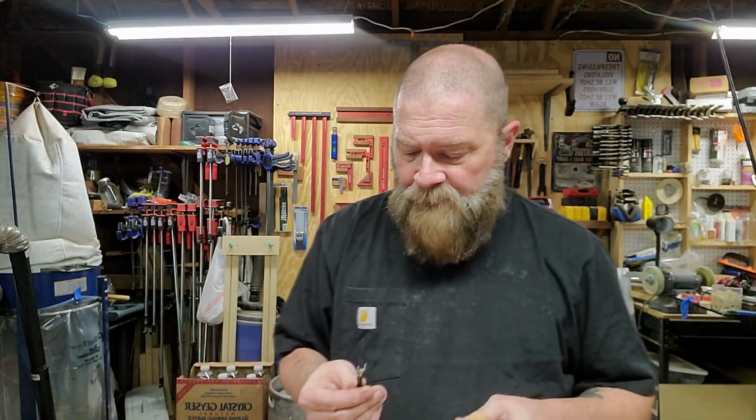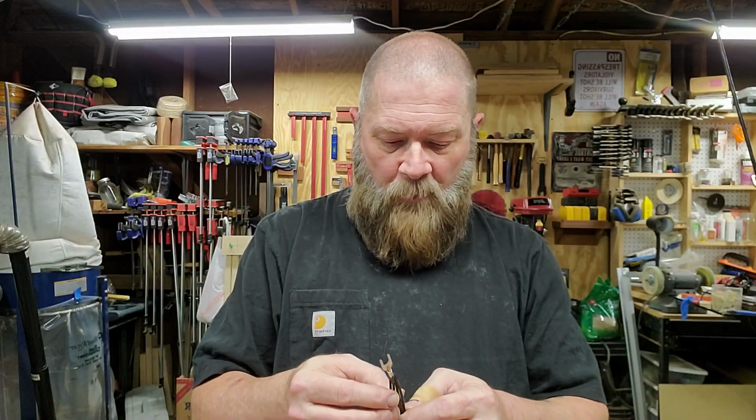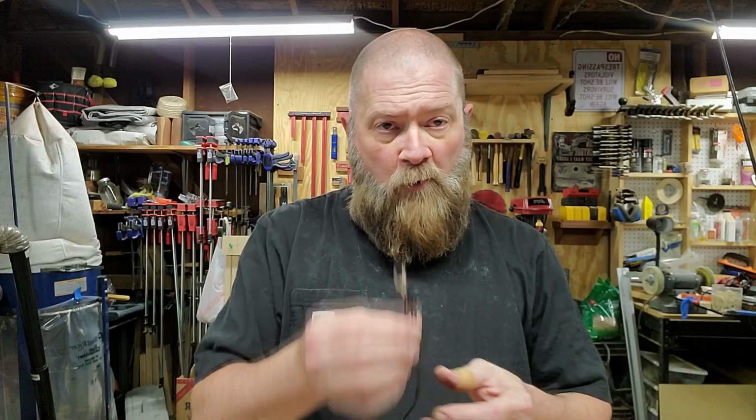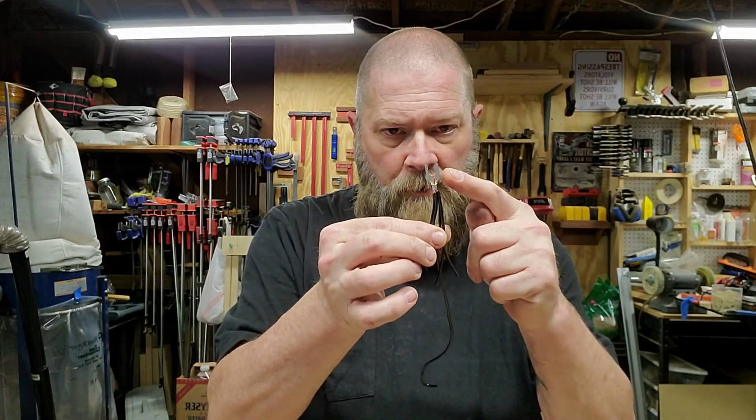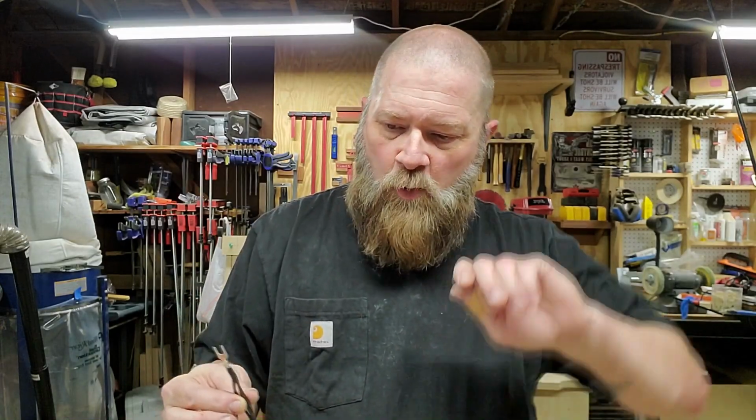I have this extra wire now that I can use for other things, or I can add it on to make even more radials if I wanted to. But what I've also discovered is, if you look at the new instructions from DX Commander's website, dxcommander.com, he's got a whole new set of instructions where he's talking about how you should probably have 4 radial wires per fork connector. And I don't seem to recall, all of mine here have 3. And I think it's because the way I twisted the wires up originally, they wouldn't fit.